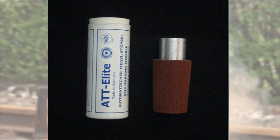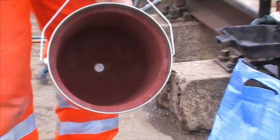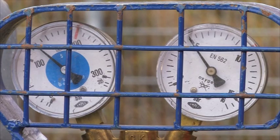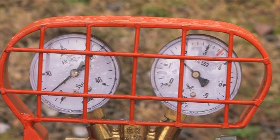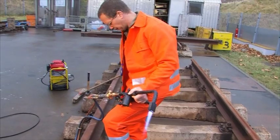The tapping thimble on the bottom of the crucible melts through after a defined time, so tapping automatically goes on. Here the tapping thimble which is set into the long-life crucible, and here the tapping thimble already integrated in the single-use crucible. The required preheating flame may be produced either by oxygen and propane, or by oxygen and acetylene, or by suctioned air and propane, or by compressed air and propane, or by compressed air and gasoline.